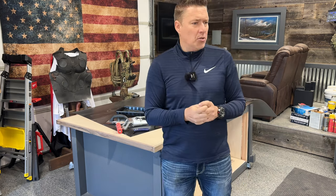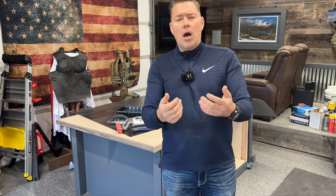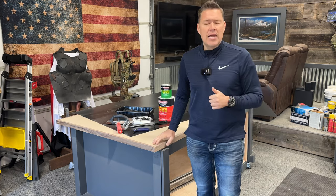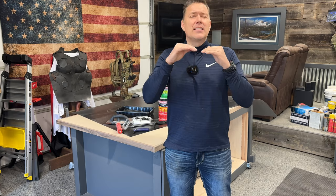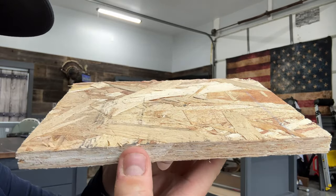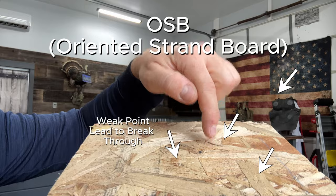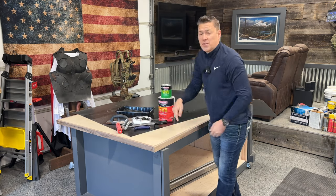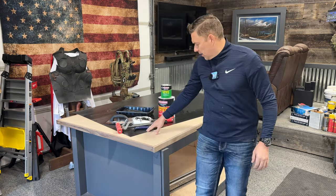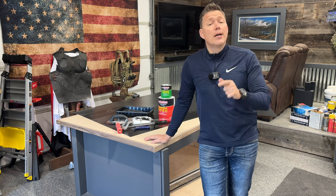As far as what surfaces you can laminate, be very careful about OSB. I see a lot of people asking if you can use OSB — it's a common question because it's cheaper. However, there are tremendous downsides. Oriented strand board is not smooth, and as this laminate goes over those mountain peaks and valleys, if you put pinpoint force down in the valley area, you're going to end up breaking through your laminate. Your Formica laminate needs a smooth surface, so OSB is unfortunately out of the question.